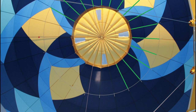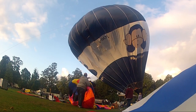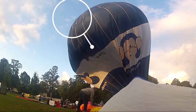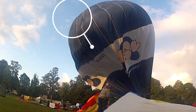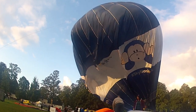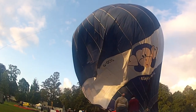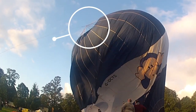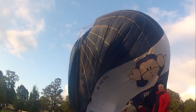Other ropes in the upper envelope include what are known as the retaining lines or centering lines. These are formed in a circular array and connect the side of the envelope to the side of the parachute. Just occasionally it's possible to visualise this from looking at the outside of the balloon — here we can see the white vertical tapes are distorted a few panels down from the top. This is where the retaining lines are interacting with the surface as the parachute is used and deployed to cool the balloon and bring it down onto the ground.